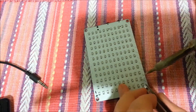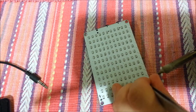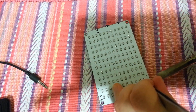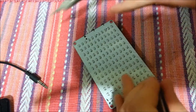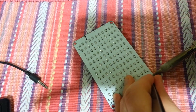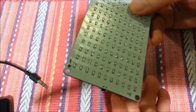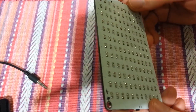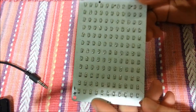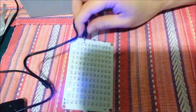Desoldering the last and final LED. Flip it around, reheat it, and then put some pressure on top as you heat the pad so the chip is flat on the board. You can see it just took me a couple of seconds to do one LED. To do all of them took maybe 10–12 minutes. Let's plug her in and see if everything survived — which it should have. And there we go.